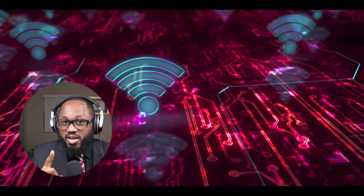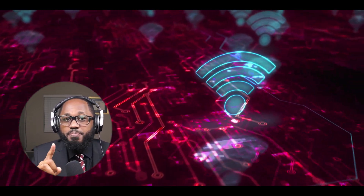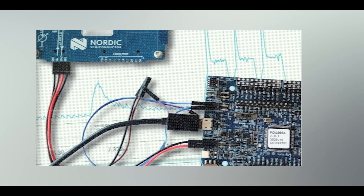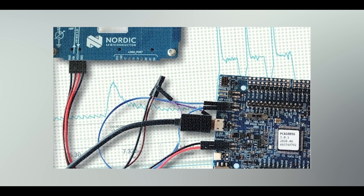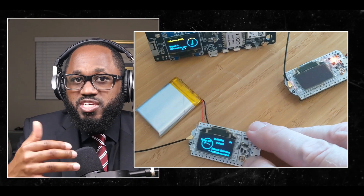Wi-Fi also facilitates firmware updates over Wi-Fi. Configuration can be done through the Meshtastic app or CLI — you can set the Wi-Fi SSID and password. Network options include NTP server, IPv4 networking mode (DHCP or static), and a static IP address if needed. The store-and-forward module for Meshtastic currently only supports ESP32 modules, making them necessary for certain advanced features. Note that enabling Wi-Fi will disable Bluetooth, as only one connection method works at a time.